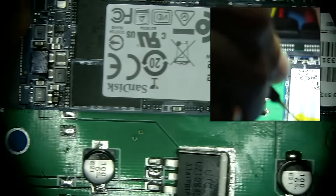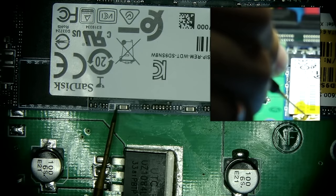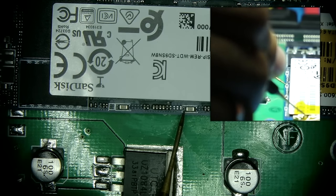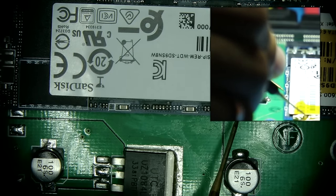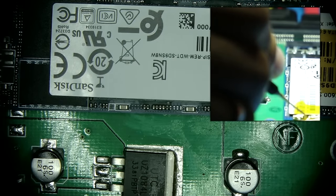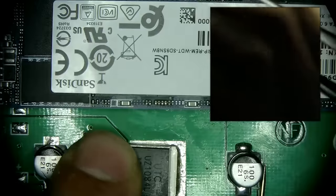And let's see what's going on with our NANDs. These are connected to our chips. So 2.5 here. We have 1.8 up here. 2.5. And again, 1.8. All right. So let's see where things stop on our failed unit.